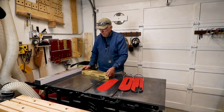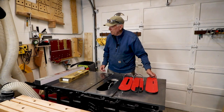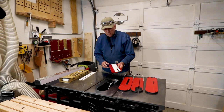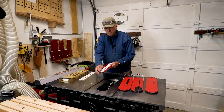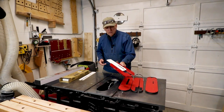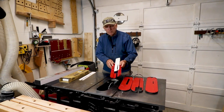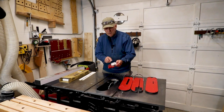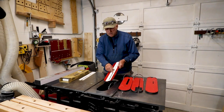This one came from Rockler, but I think it's actually the SawStop device. Here's what I discovered — it's a bigger initial investment, but after that it should be a lot less expensive. I got this from Infinity Tools; the brand looks like it might be called Cauliflower, though it's hard for me to read. What it is is two pieces: there's an insert you can take out and replace with another one. It's made of anodized aluminum so it won't conduct electricity — at least they say it won't — so I'm not worried about it setting off the brake on my SawStop.